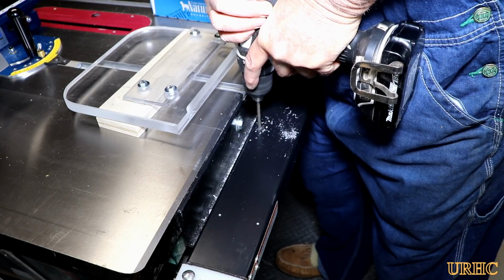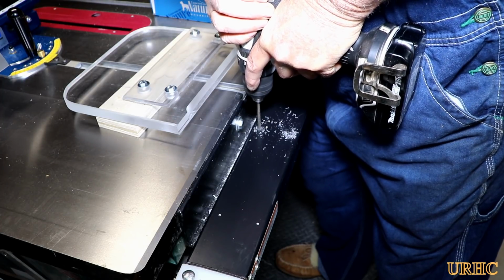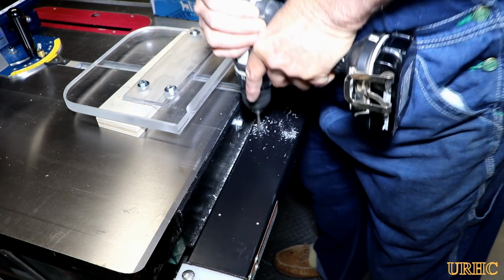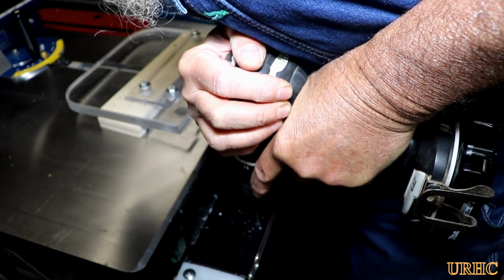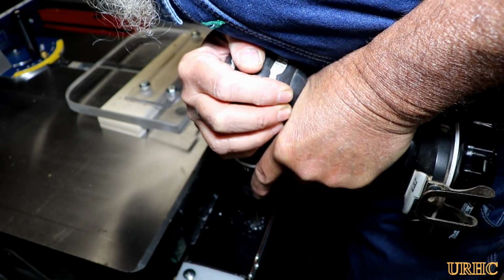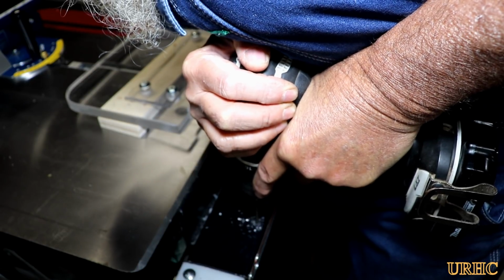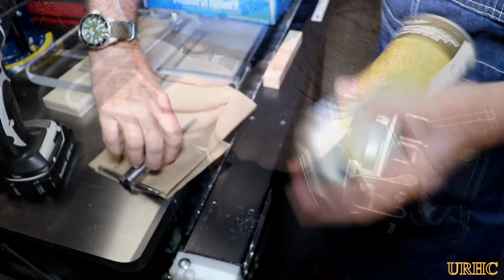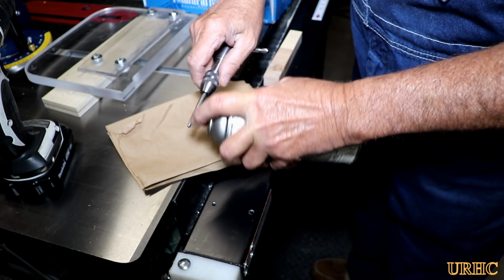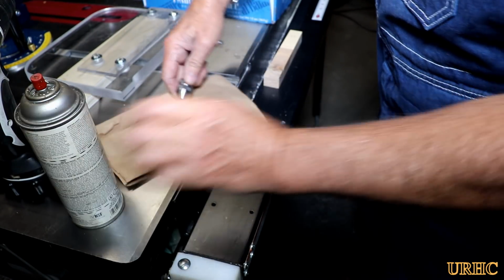And so the next thing I'm doing is, I guess it's a number 7 drill that you use for the tap drill on a 1/4-20 tap. So I'm going to just drill out those 4 locations that I dimpled when I drilled those other holes, and then go back and put a 1/4-20 thread in each one with a tap.